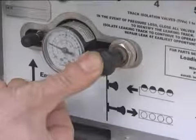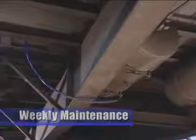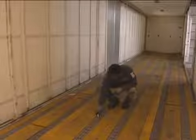Although the Hydra Roll system is very simple to operate, it still requires preventative maintenance to keep it operating properly. A weekly check includes draining water from the air reservoir and control box by tap or cable. Visually check the track for obstructions, which may prevent proper movement of the rollers.